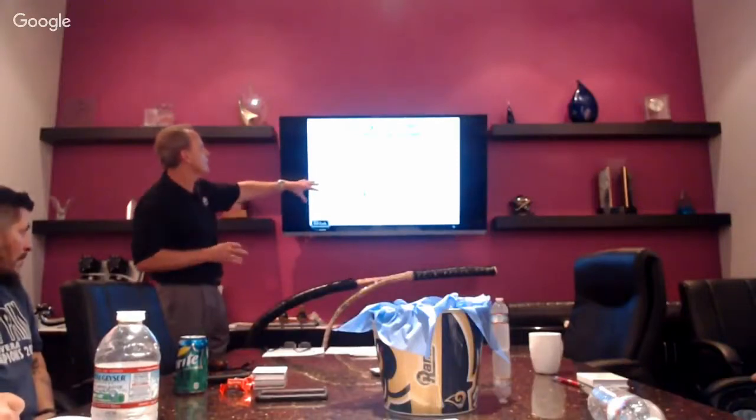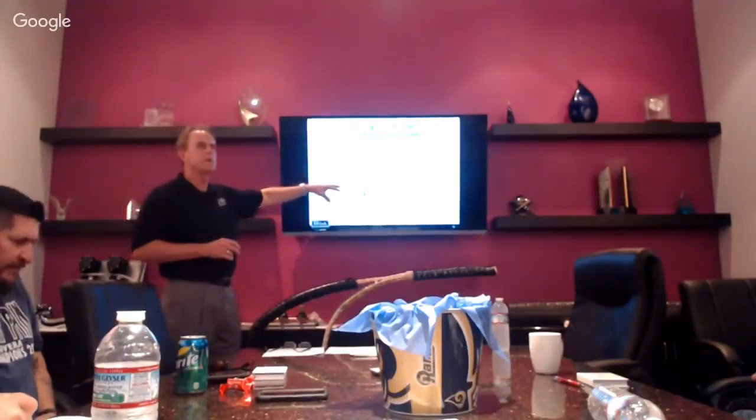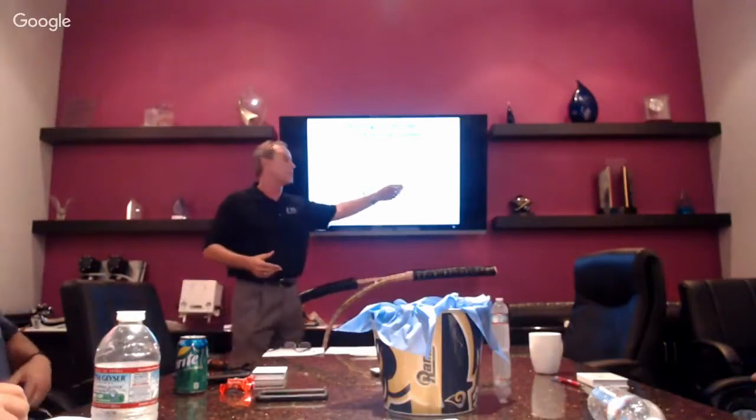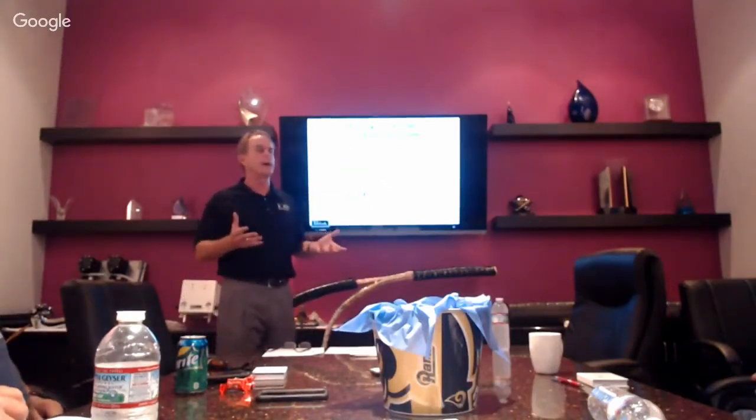This is what you would call a low pressure system. Everything is downhill. Nothing is going up above the walk-in. And the theory is you can push this with straight CO2 if it's 75 feet or less. I'm not real wild about it. I would still rather put pumps or a blender on it, because if the temperature changes a little bit or the pressure changes a little bit, you're getting foam. There's nothing you can do to make corrections.